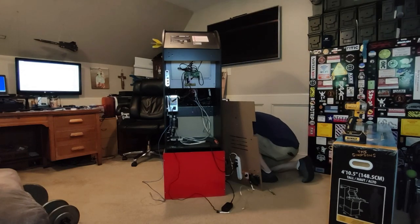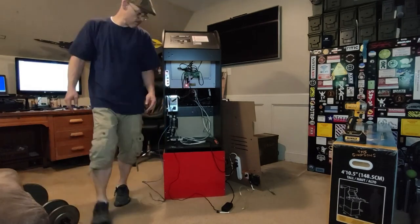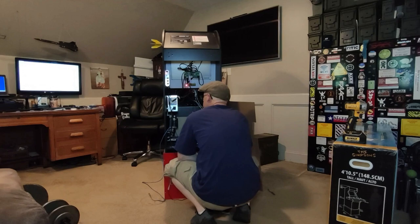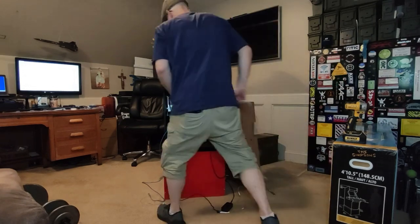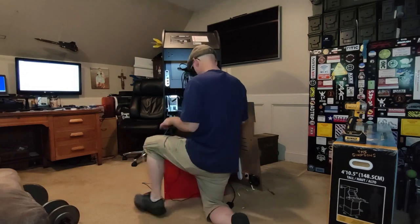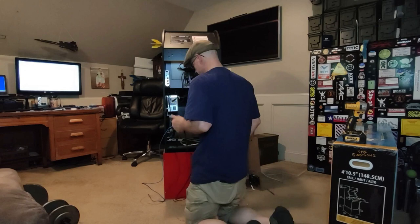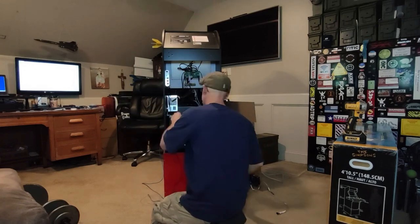At this point in the video, all I really know is the Mame cabinet isn't powering on. So the first thing I'm going to do is check all of the connections and see if there's a simple fix. After checking over the AC electrical connections, I'm now sure that power is getting to the computer power supply. However, the computer is still not booting.